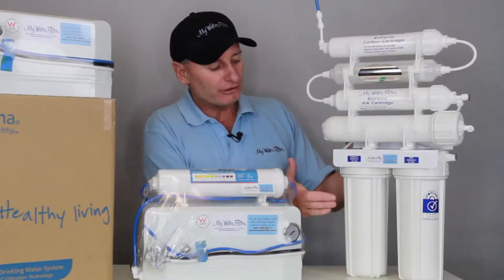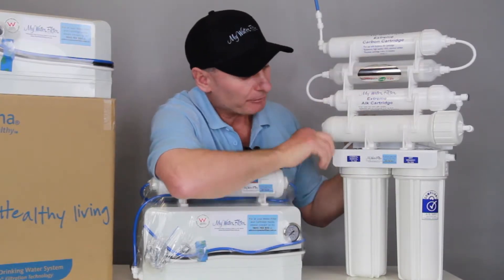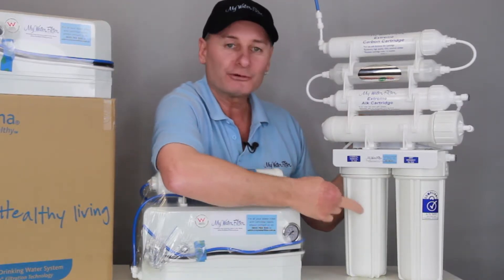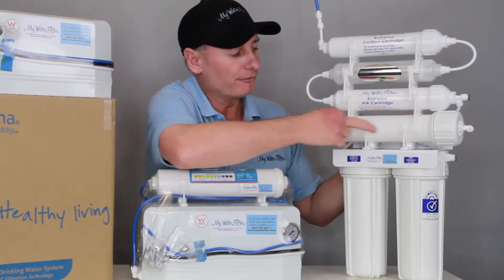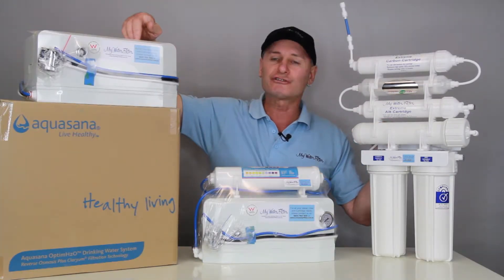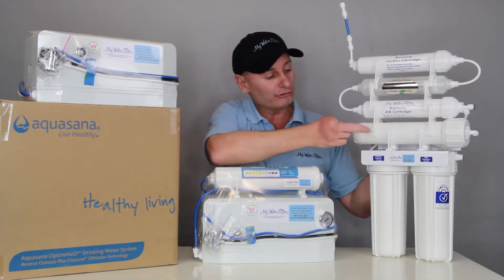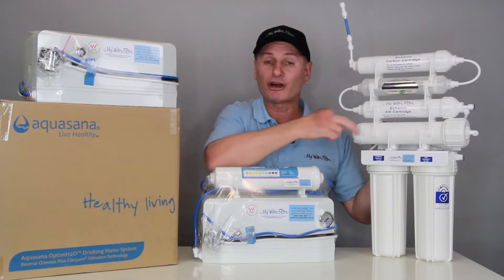To give you an example, this here is a good old-fashioned twin water filter. Basically how it works — the water comes in this side, and in this cartridge is a sediment cartridge that takes out the lumps and bumps. Then the water comes over into this carbon cartridge, which takes out chlorine and chemicals. These are there to clean the water up before it comes into the membrane. So stage one is sediment, stage two is carbon, stage three is the membrane. Inside these RO systems, it's the same — these inline cartridges work the same way.